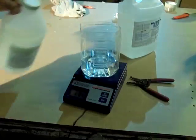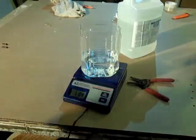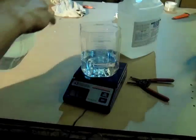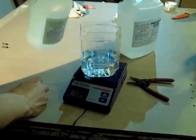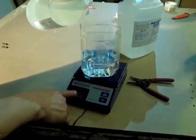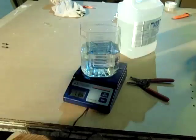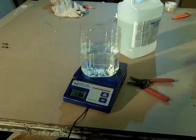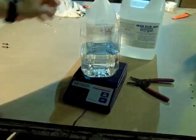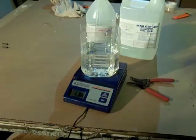So now what we need to do is take this one and go to one pound, eight ounces — that would be one pound eight ounces, and that needs to go to six. So that is the perfect mixture. The nice thing about this is it has a very long pot life — about 50 minutes or so is the work time, and then you want it to cure overnight.